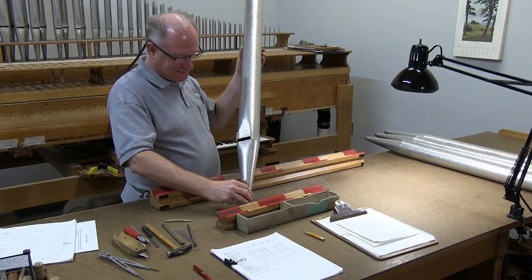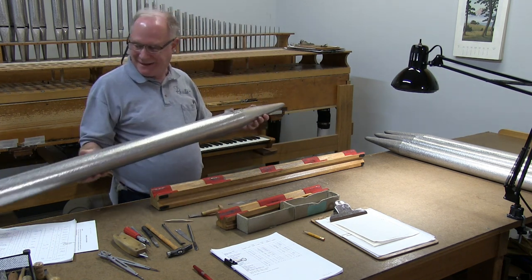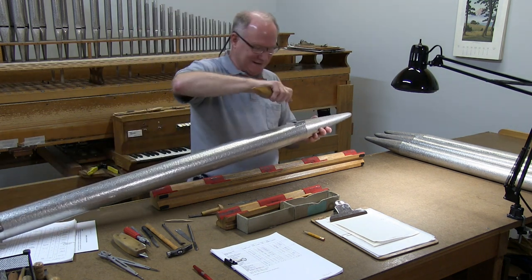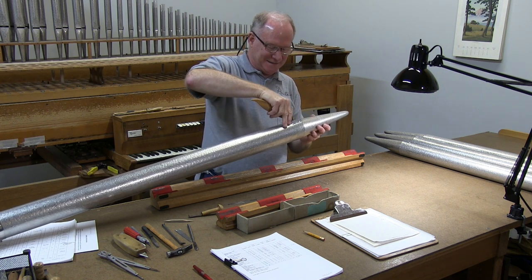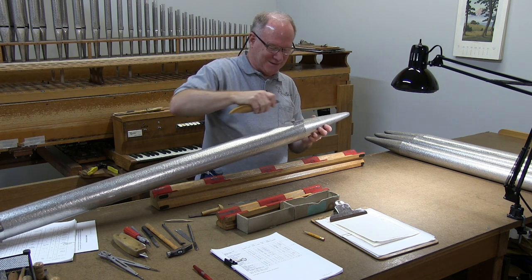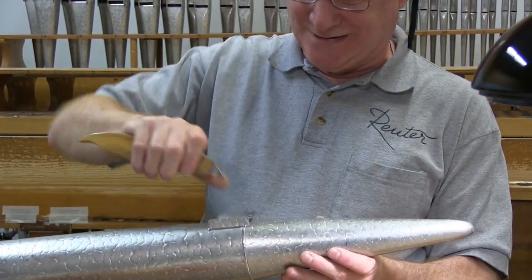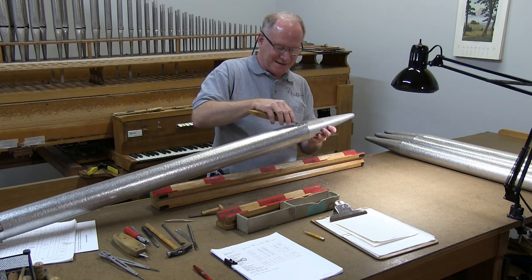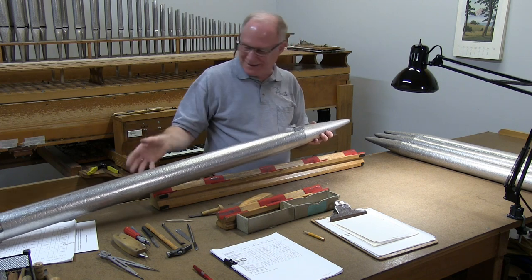And then on these particular pipes, we put a bevel on the upper lip. We call it a skive. And I will just scrape across. Now some people will actually cut, but I always find that kind of dangerous, because usually you take out big chunks or gouges that you don't really intend to. So I just scrape across it, and then this other side is kind of sharp, so if there's some little pieces of metal left behind, I can clean those out of the corner.